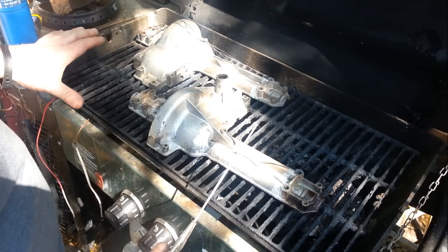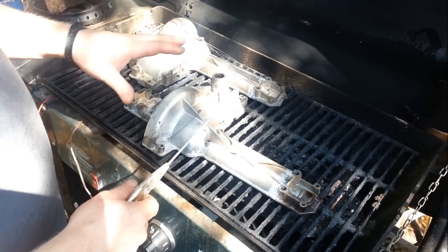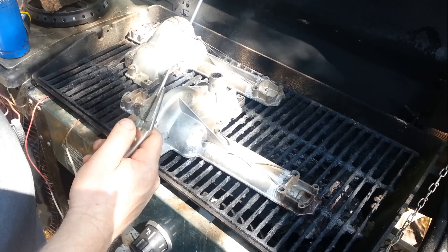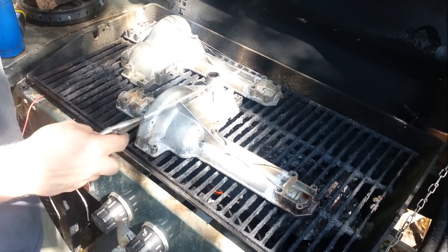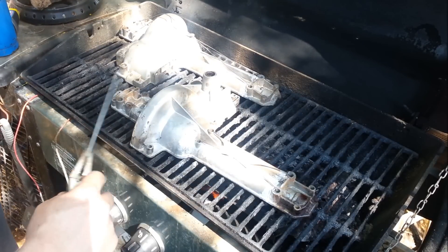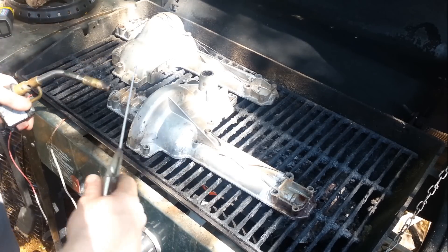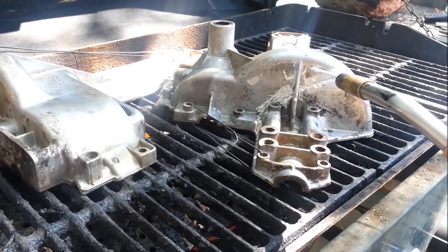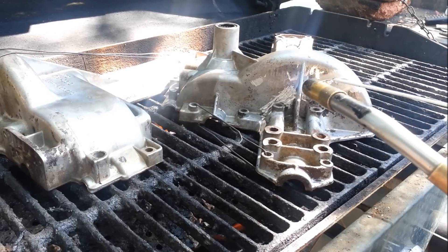You need the pieces held together, clamped together, or something to that effect. The melting point of aluminum is about 1,200 degrees Fahrenheit, but the melting point of this rod is only about 730 degrees. The grill is probably going to get them up to about 400–500 degrees, and then I'm able to use the torch to get in there the rest of the way, heating up the whole area until I see this start melting on its own without the torch.